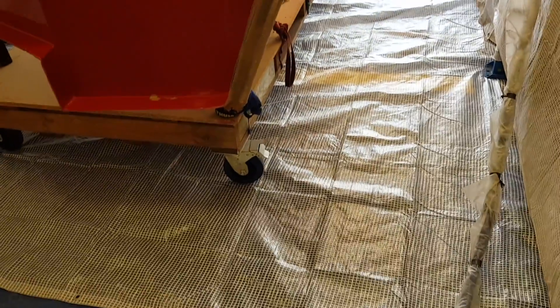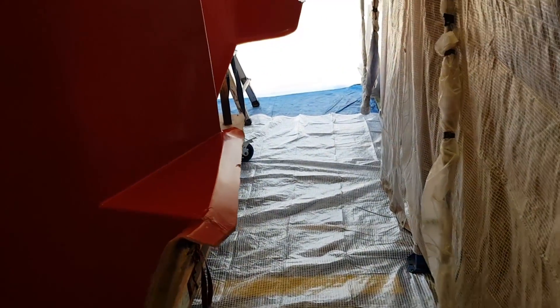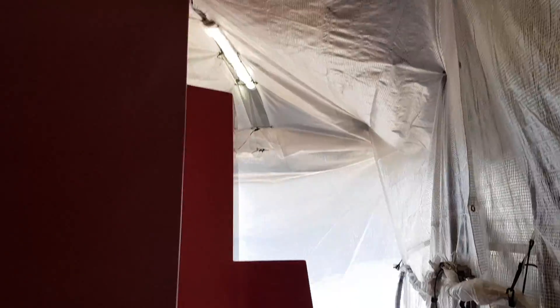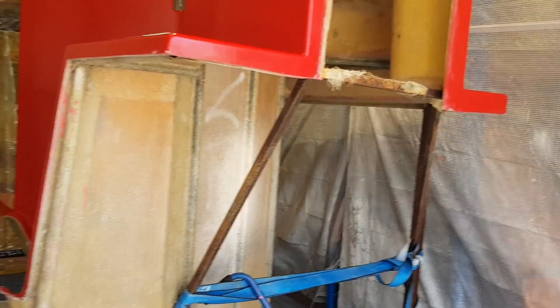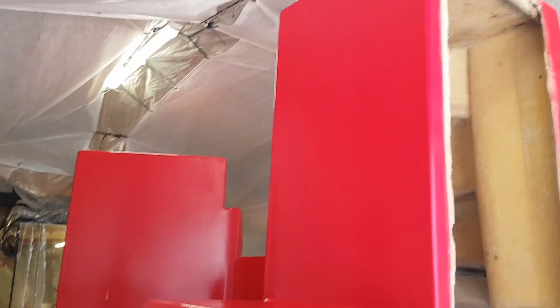We're at three days so far of polishing, restoring, and release waxing. Then I put down a tarp here and I cable tie it to the sides of the studio spray booth — that stops it from lifting as I walk on it, because no matter how careful I am there's going to be overspray in this room. I've also lifted the roof by about two feet to allow for the height of this module. I'm going to need two ladders — a step ladder here and another one up the other end — so I don't have to move ladders around. Last time I did a big one like this it was exhausting just lugging a ladder around.